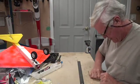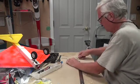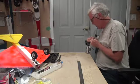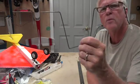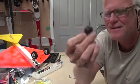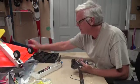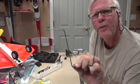Let me see how it works. What you should do is set it on the table like this and make sure it's square with the table — no toe-in or toe-out at all. This one can be bent just a hair more. There we go. So there's one landing gear, made using this handy little device in a bench vise that just clamps onto the wood. I took the soft jaws off and used the hard jaws. That's how you bend wire for a landing gear.